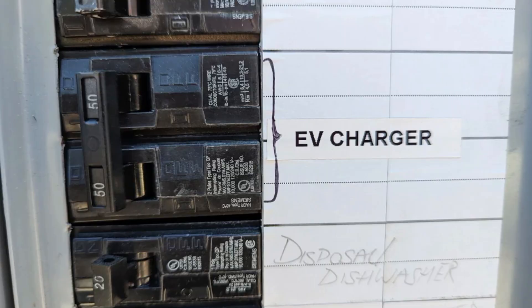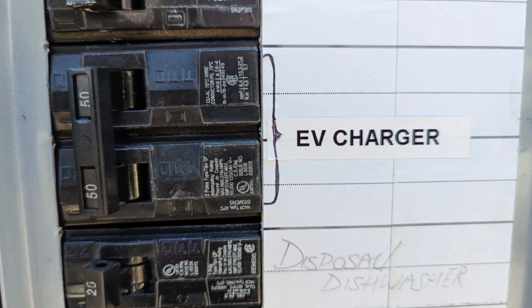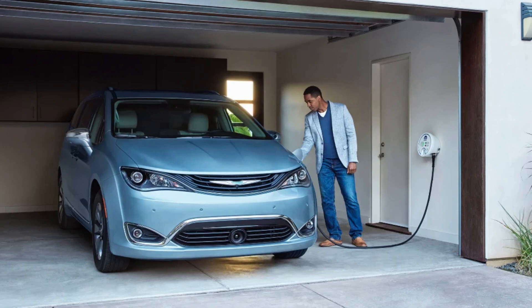One solution is to use a dedicated line for charging the Jeep 4XE — a line that has a dedicated circuit breaker. You shouldn't charge your Jeep on any line that has other appliances connected to it, like a kettle or other household appliances.